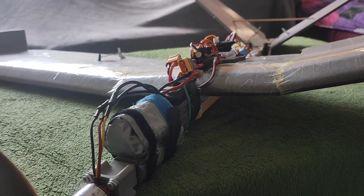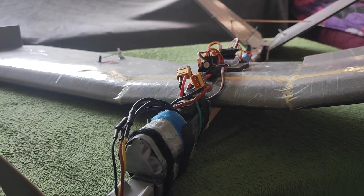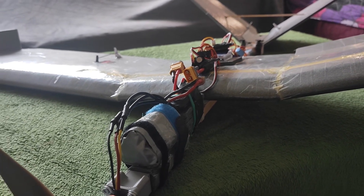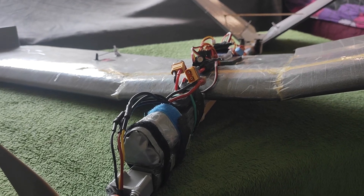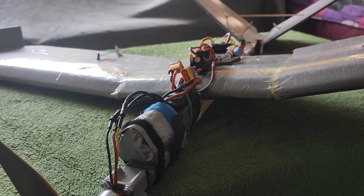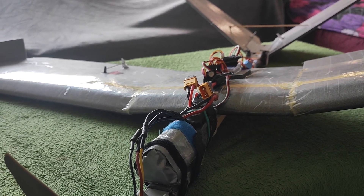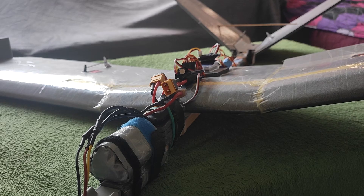The main advantage of this design is the flexible wing mount. What it means is when I hit something, the wing will detach, fly off or bend and flex. If it was rigid and I hit something, the impact will go through your mounts of the wings to your fuselage and potentially break something.